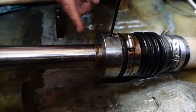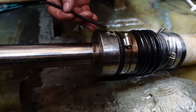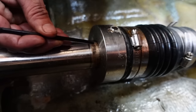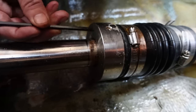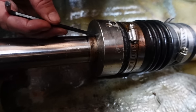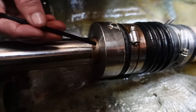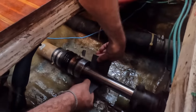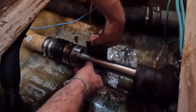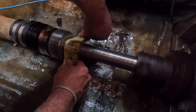I've just loosened the collar and tapped it back, and you can see there is the imprint of the grub screw on the shaft. The only thing I don't want is for our lip seal to go anywhere near that. So I'm going to aim for around halfway between there and where it originally was. This was originally sitting on the black mark I made — and there's the grub screw mark that's damaged the shaft. I need to clean up a 20mm section and get that surface really nice — no burrs, no jagged bits, just a nice smooth shaft.